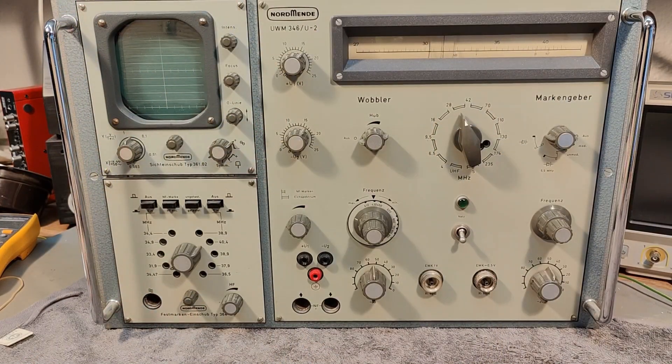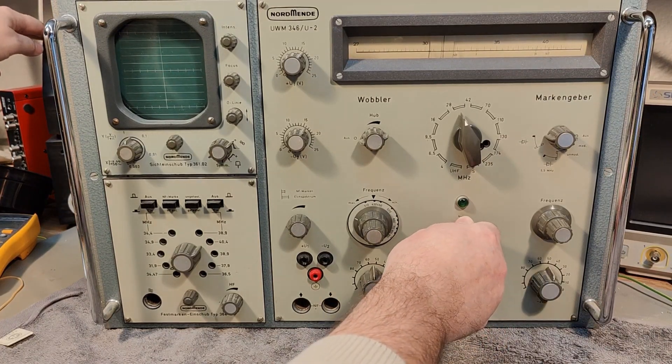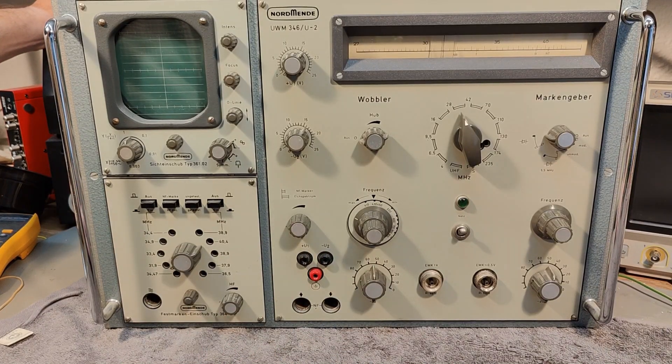Can you imagine designing stuff like this without CAD? They've got to have patience and a lot of paper. So this is my first power-up. I'll start with a very low voltage to see if anything happens — only 15 volts and I measure only 1.2 watts. This tells me there isn't any short. At 50 volts it's using 10 watts.